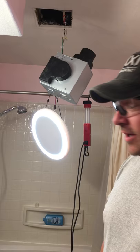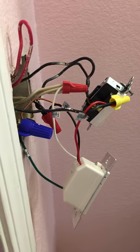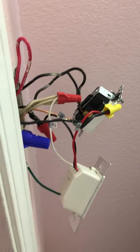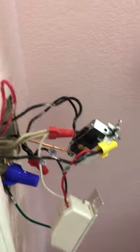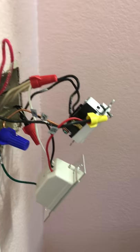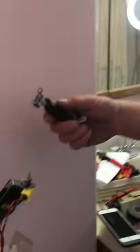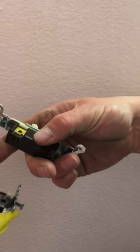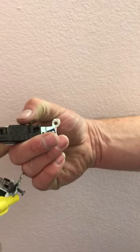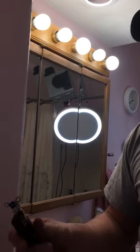The piping and getting it connected to the wires wasn't the problem — it was figuring out the wiring that was the problem. We have four separate wires coming in with only one hot. We found out that the two switches we had, with one hot coming in connected to other black wires, which lit up the vanity light, the recessed light, and the light for the fan. And then one switch was just to turn the fan on.